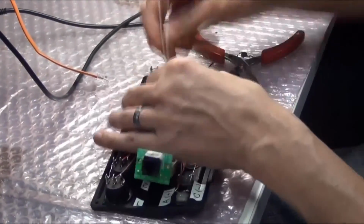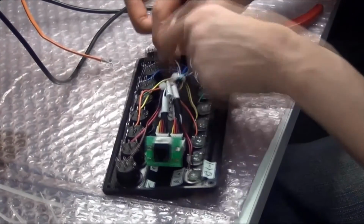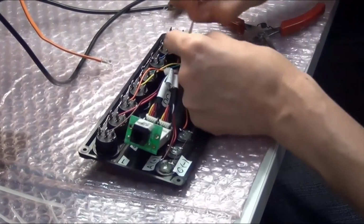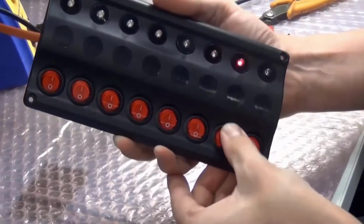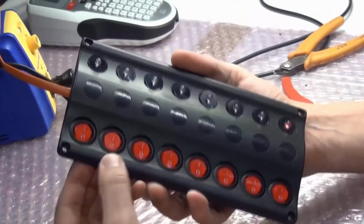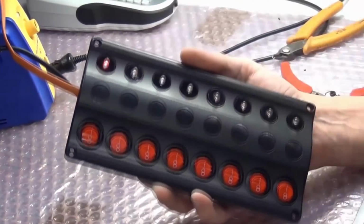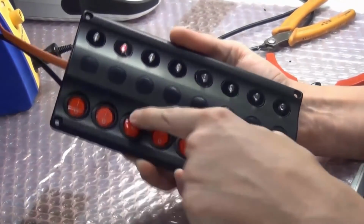It is recommended that once the wiring and soldering are complete, you neaten up the wires. This can be easily achieved with cable ties, for example. All exposed wires and connections should be isolated before final installation. Once the outputs are connected to the LED indicators and the inputs connected to the mechanical switches, test them to ensure that they are all wired per the default settings. Note, no connections to lamps or programming for switches to control specific areas has been completed yet.